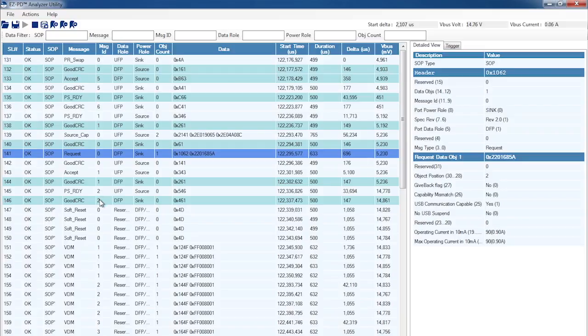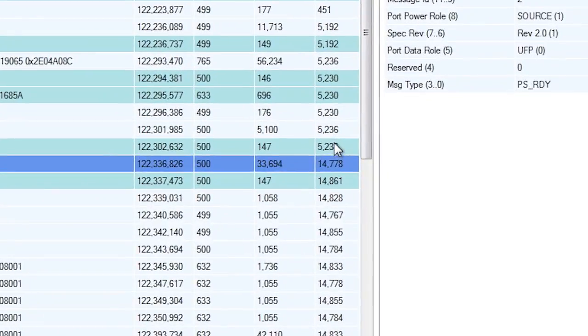That means 10 volts will show 200 and 1000 milliamps will show 100. If you remember from the last video, the Type-C power adapter can supply two power profiles: 5 volts at 1 amp and 14.8 volts at 1.4 amps. Since the kit can accept 14.8 volts and requests 900 milliamps — which is obviously less than the 1.4 amps max that the adapter can supply — that's what it requests when I connect the power adapter. It asks for the higher voltage since that will allow faster charging.